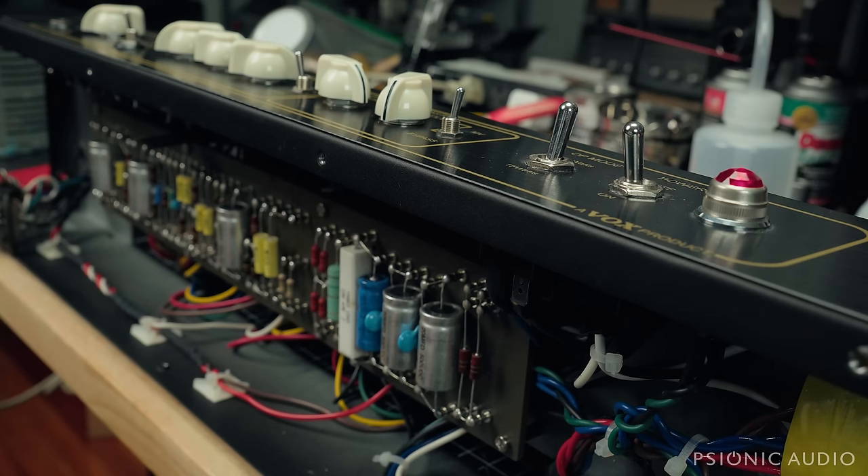With the bad EL-84s the B-plus was drawn down a lot — like to 280 versus about 320. Normally the hum would come up and then fade away on an AC30 or other cathode-biased amp as the tubes warm up, but it just doesn't fade away; in fact it gets a little bit worse over about a 10-minute period. I will probably need to change this big white resistor — that is the main resistor for the bias in the 30-watt mode; it is a 47 ohm, measures 47.4. I may go to a 68 or even a 72 ohm resistor and find where the tubes will be biased properly — meaning with 120 volts from the wall, I want to see somewhere between 12 to 14 watts idle dissipation. I will get there once the new tubes arrive.